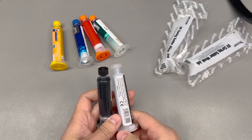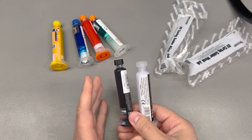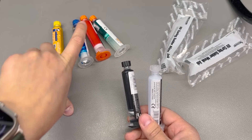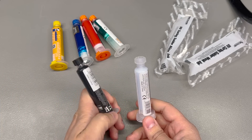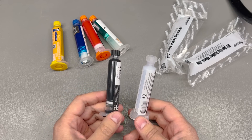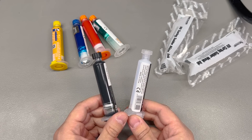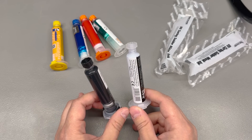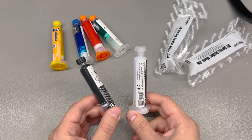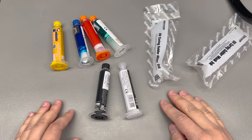Next up I got two more colors of UV curable solder mask, and I think I now have all of the commonly available colors: yellow, blue, red, green, black, and white. I use these for repair purposes — whenever I have to bodge something on a PCB, do a repair, cover exposed copper, or use a drop as mechanical support for a thin bodge wire. It's nice to have them in different colors for a clean end result no matter the solder mask color of the PCB I'm working on.